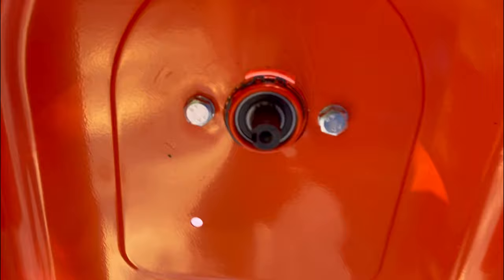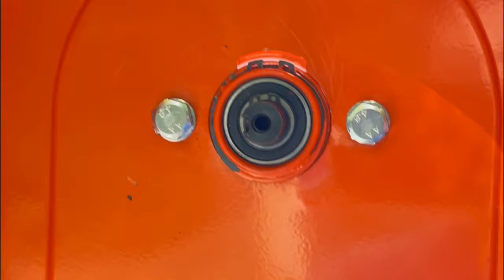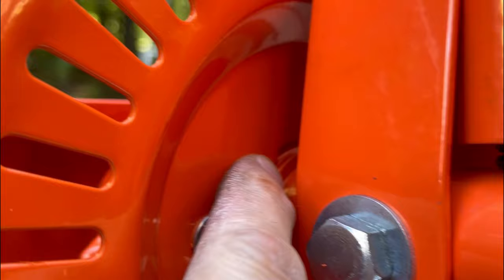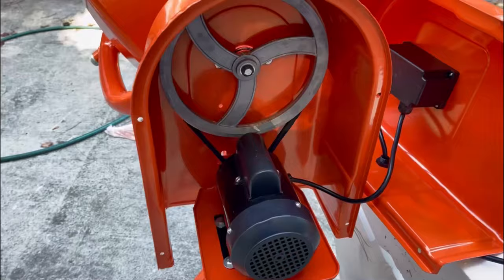When attaching the motor hood on this side, the motor comes attached already, so you have to disconnect it with some zip ties and one bolt. Up top here — if you see that slot — the snap ring was down there and it was kind of offsetting things so it wasn't sitting flat. You may have to knock that around to the opening groove. Keep that in mind. You can move it back up to the slot right there, and that's where it's supposed to sit for accessibility.